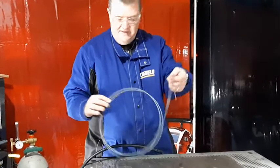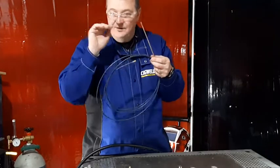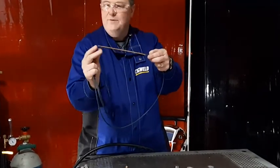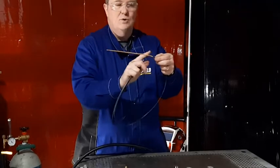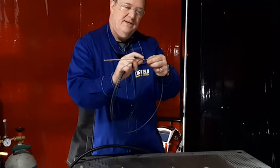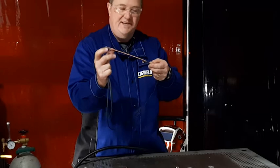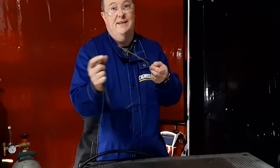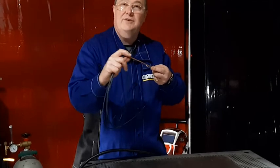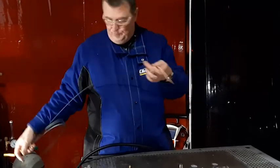Then you've got to feed this in — a nylon liner, which means the aluminium wire will glide down it nicely. At the end away from the contact tip is a thing called a jump liner, and this is copper — you can get these in copper or brass. It's screwed onto the nylon liner and acts as a heat sink so it doesn't melt the nylon liner down at the tip. It also acts as an extension of the electrical conductivity to the contact tip, so it's a very important thing to have.